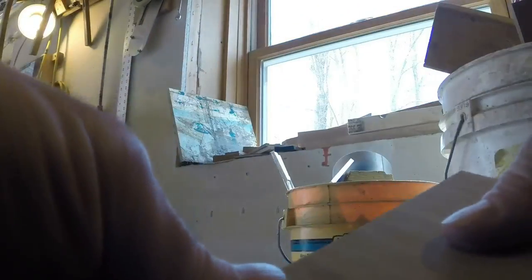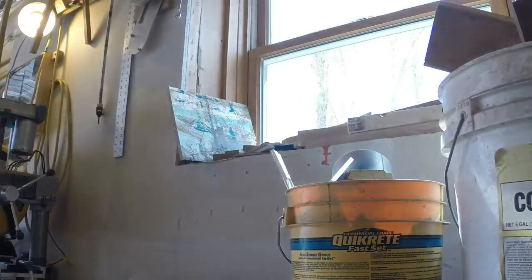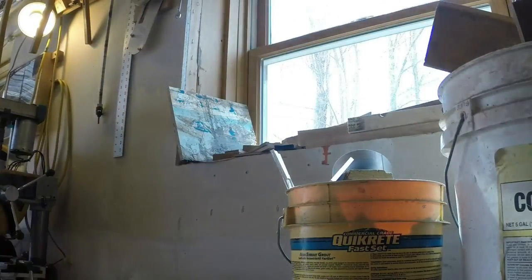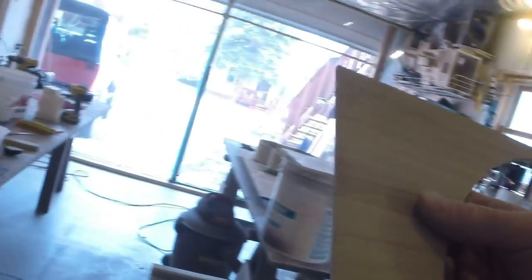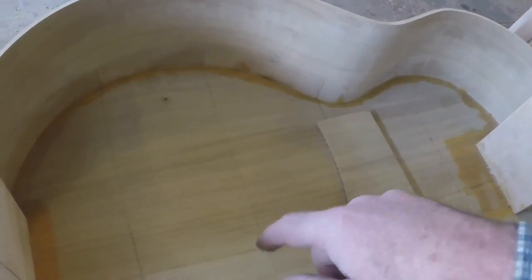So here's my issue: if you're strengthening the brace and you glue a piece in, let's say these are my two pieces — I glue them together, they're supposed to be stronger. Well, this is pretty weak, right? I'm going to get a little strength — let me try to break this. Easy. Okay. Now if I put my pieces like this and try to break it — there's just no way in hell I can break it. So I don't know who designed this guitar, but if you're putting a guitar together off of plans, watch out really carefully. Look at it, pay attention, and think about it.